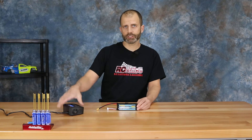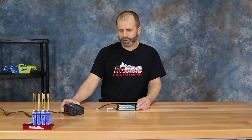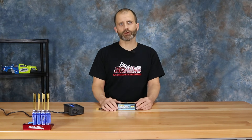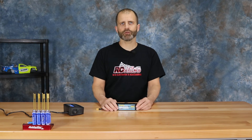If you've got a battery that's been drawn down too low, plug it into your charger. As far as current, it doesn't really matter — you can use the same current you'd use to charge your LiPo battery normally. If you're going to use 5 amps on your LiPo, set it in NiMH mode to 5 amps for 30 seconds or a minute — it'll spike up the voltage quickly. Then stop that charge cycle, put it back into LiPo mode, and you should be able to charge your pack as normal.